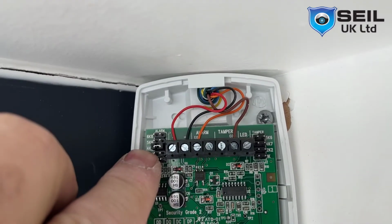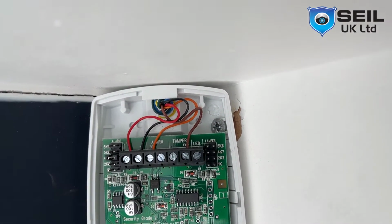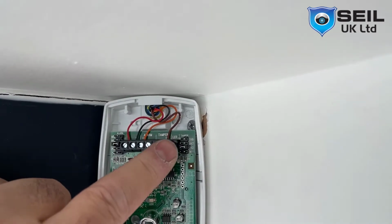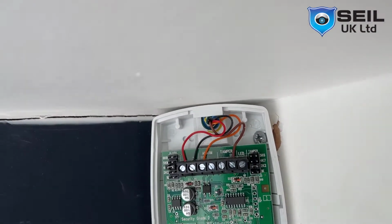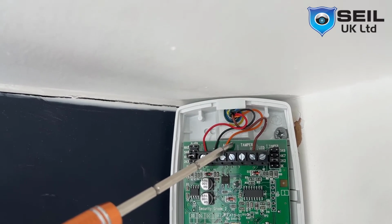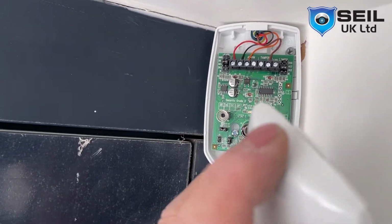Put 4K on the alarm side, tamper side, I use jumper on 2K2, yeah. So, 2K2. Okay. So, all sensors doing like this. In this cable, I use one cable, I use two sensors. So, one sensor in the hallway, the back side, I'm going to use yellow and blue, and power is common. Okay, so I'm going to close this cover. This side is cover complete. So, need to put on top first.